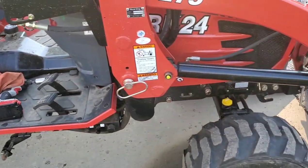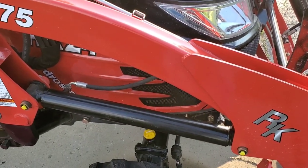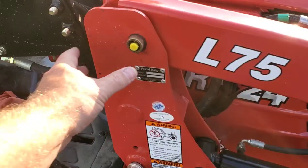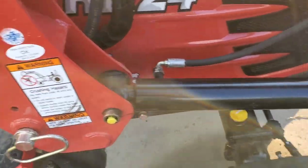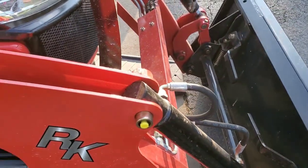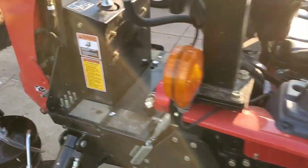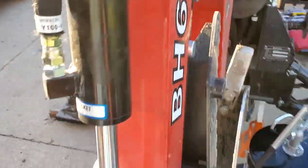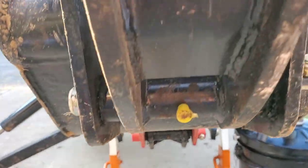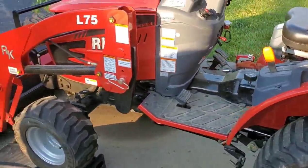We're back out here. On the 50 hour service — and generally just touch them up, you know, about every eight hours of use is a good practice — to keep them good and greased. Go around all of your zerk fittings here and just put a couple pumps of grease in them. They're all over the place — anywhere something moves, look for a zerk fitting. They're on both sides of the loader as well as back here on the loader itself. On the backhoe part you've got little zerk fittings all over. So you want to make sure that these are good and greased on this 50 hour service.